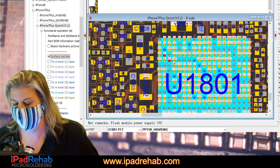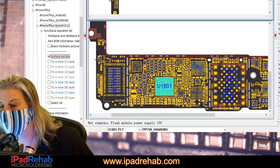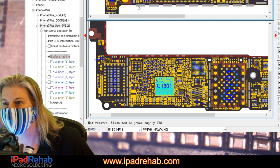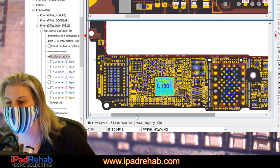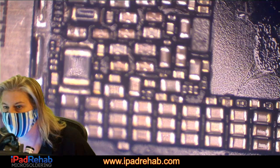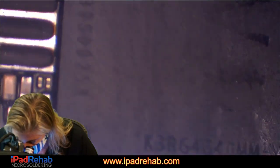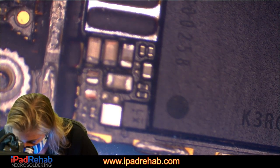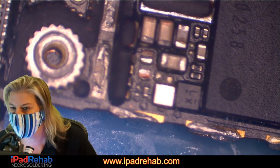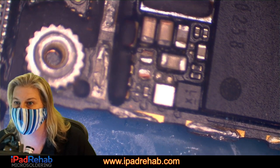PP1V8 Hawking. All right, where does PP1V8 Hawking go? Give me a spot that I can measure PP1V8 Hawking. Right up there. All right, let's go on a hunt and measure PP1V8 Hawking, which is over here. Is it the second one of these guys? I don't remember. Let's go figure it out. It was, yeah, the left side of the third cap right there.